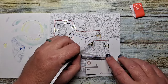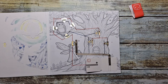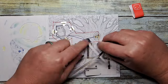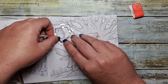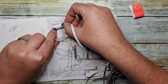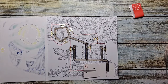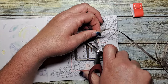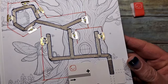Now we just have to apply our conductive fabric tape. I'm going to start with my negative side, starting on the inside of that battery holder. There we go — we've got our first piece. It bends just like you need, and if you need to trim it to make little legs or to extend it, you can. To create corners, all you have to do is bend it back on itself, and it's super easy. You can even make it fairly rounded instead of having straight tape. A reminder to make sure that your two sides of your circuit don't overlap. I did realize at this point that I had forgotten to add one of our stickers, so we're going to put our last little leg there. And there's the negative side of our circuit — very simple. As long as you overlap that tape, your circuit is done.